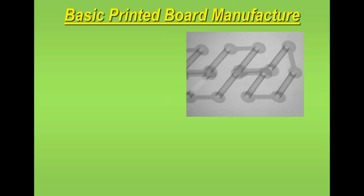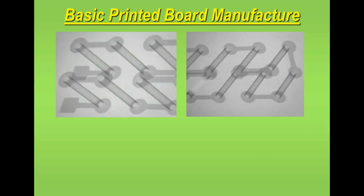on this failure mode. Now I mentioned X-ray, and we showed a couple of X-rays earlier on, and these are just examples that I threw in just to show you how you can pick up poor plating with X-ray. These are on 0.2 vias on a 3mm thick board, and if you're not familiar with X-ray to any great degree of detail, just look on the right hand photograph on the left hand side and you can see where the plating is missing on one plated through hole. I'll illustrate it here, but that's where it's missing. So you can't measure the plating thickness with X-ray, but you can see whether it's there or not.